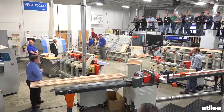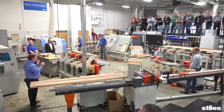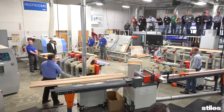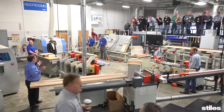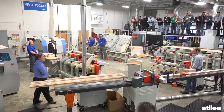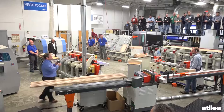David will set up on face frame material while the others are operating equipment, and we'll run some face frame material at the end of the presentation. Once we get past that portion, we'll be running all of these machines together but talking about them individually — starting with the iron run upcut saw and the Tiger Stop. We'll also go into detail about optimization. Jeremy will be working on the unique 310 coping machine, and Brian will be working on the 422 shape and sand, processing the outside edge detail of the finished door.